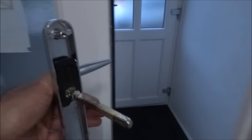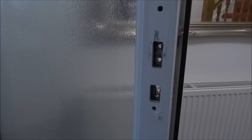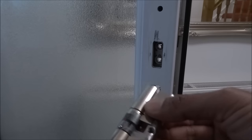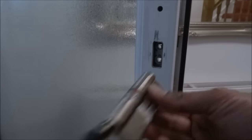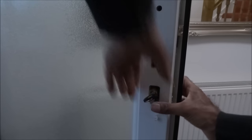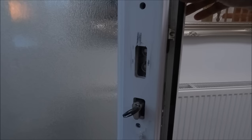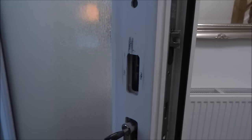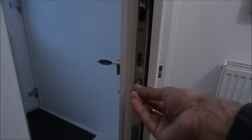It should just pop off like that, so you've now got a door with no handle. Now we can put in the high security Euro cylinder. I'm going to straighten up the tag that moves the locking mechanism, then gently slot it in. That sounds like it's in place. I'll adjust it slightly — you can see it's sticking out the other end as well. Now we'll put the screw in to hold the lock in place.